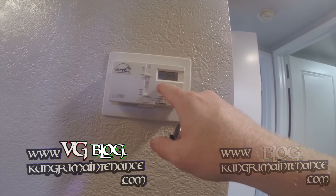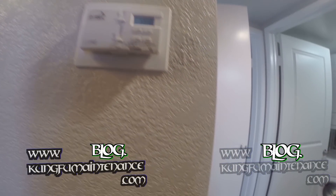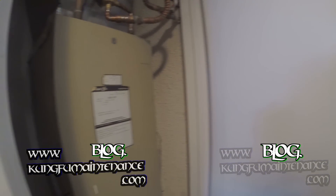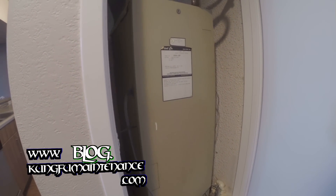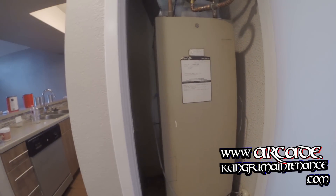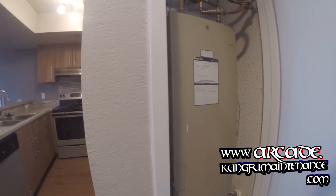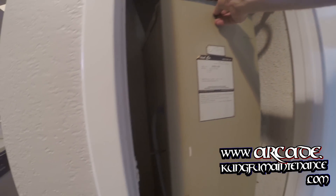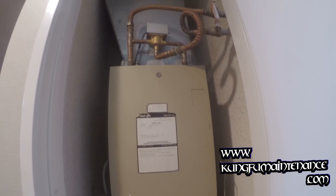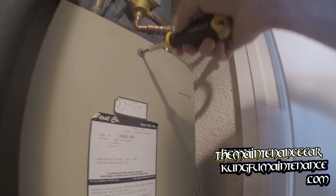Use the hold button. The reason is because the air conditioner of course removes moisture from the air, and that's how it absorbs a lot of the heat. The moisture runs down the drain. It absorbs the heat into the refrigerant, cycles that to the condenser on the roof, and releases the heat outside of the dwelling. It actually removes heat from the unit — it's not really that it brings cool air in, it brings the hot air out.